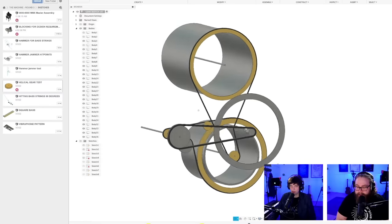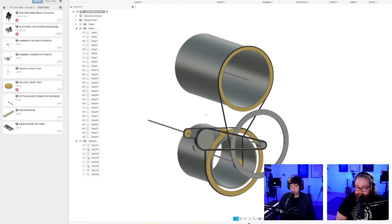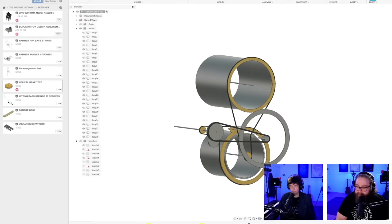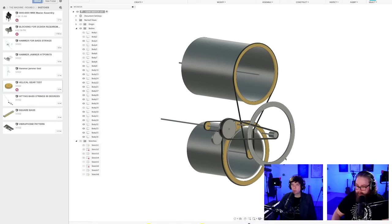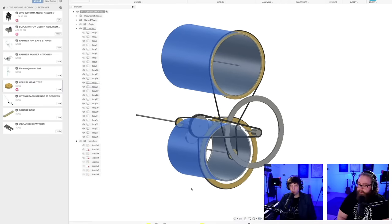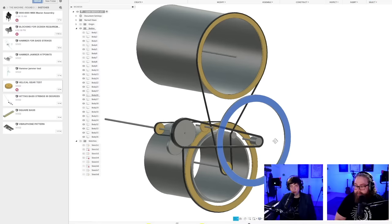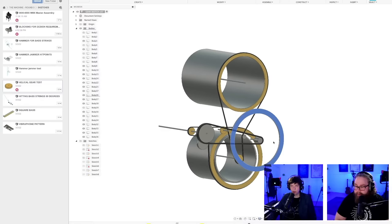We have a question here from Kanal Frump. What about braking? Inertia of the flywheel and all the masses on the timing belt. Will a distributed brake system have to be added, acting simultaneously in several places for a coordinated slowdown? No, because these drums are rotating super slow. So there's almost no moment of inertia in them. All the power in the whole machine is in this one flywheel, so we only need brakes on the flywheel. If the flywheel stops, everything else stops.